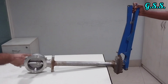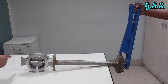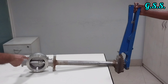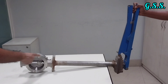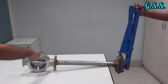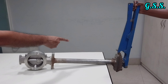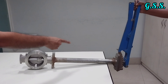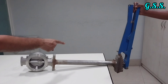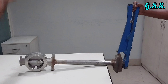We should not install a cryogenic valve in a horizontal plane with the stem horizontal. In that case, cold liquid will flow into the extended bonnet, the entire bonnet will become cold, ice will form over the bonnet and lever, and the valve cannot be operated.